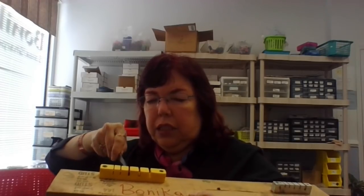Now, it's good if you don't bend exactly, if you're moving a little bit, just a millimeter or two, so you're not doing all the bending right in one spot. Getting a little better. But you always run the chance of it going ping. And that's just trial and error. And I suggest get you a bad blade like this, bend it out of shape, and practice with it.